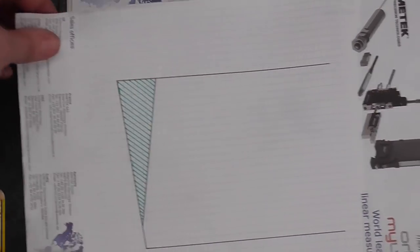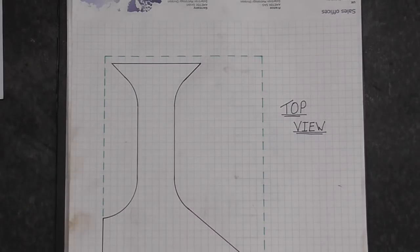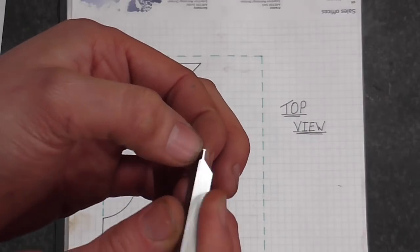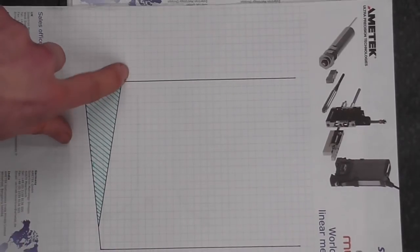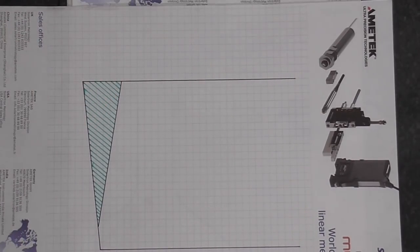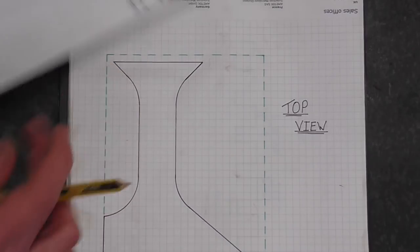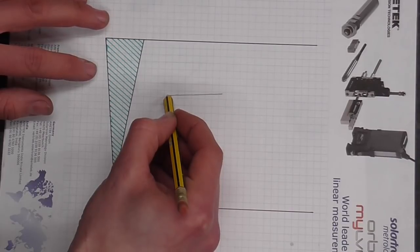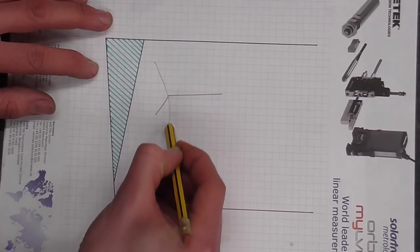Now, that is the case if we were to take a cross section at this root, as I said, but I need to show something quite important. As the tool comes out closer towards the very tip of this cutting edge, that clearance angle has to increase quite dramatically to clear the radius that was going on. In other words, as this tool was operating within that piston ring ID, the actual clearance angle of the tool had to be quite steep to clear the radius being machined.